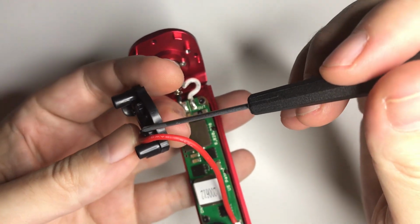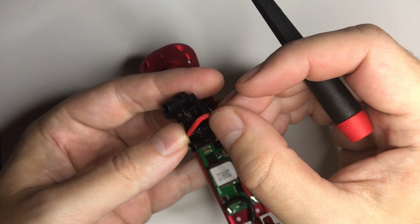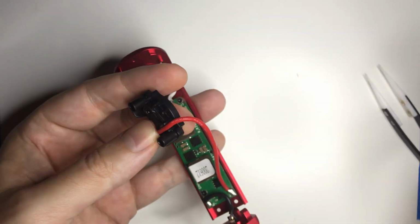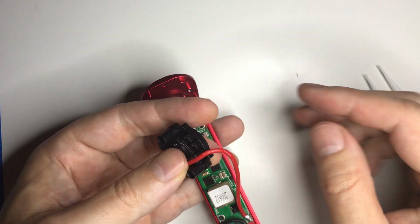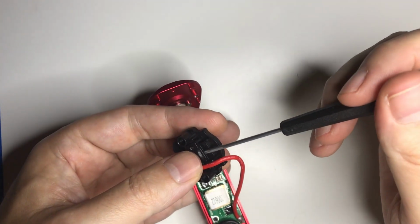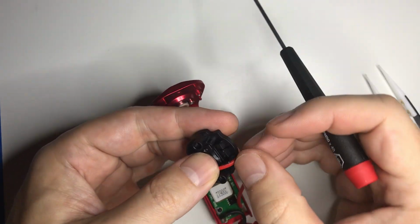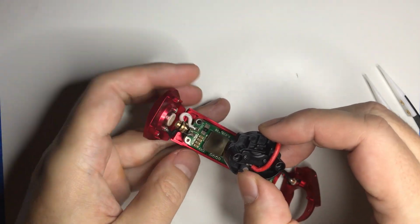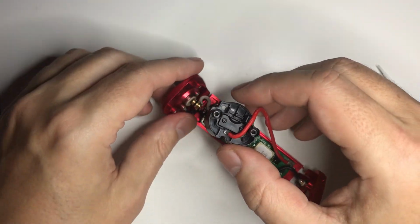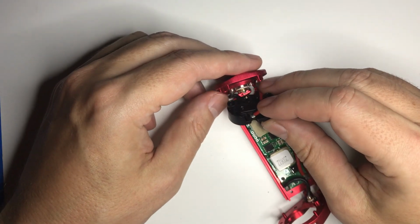you can see here, this plastic comes up a little bit more. It's going to keep the wire from coming over here and possibly getting frayed, and again, shorting, causing an auto fire. So they took into account that there is a moving component right here going up and down, so we want to make sure it doesn't hit anything, and they've done that. So that's a nice feature and interest of safety, or at least design decision.